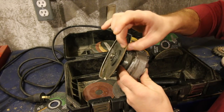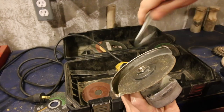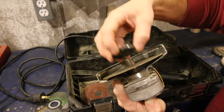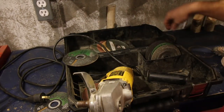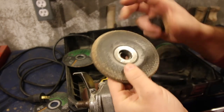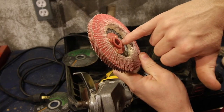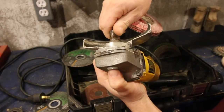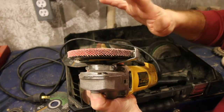You can cut and sand just about anything with a good grinder. One thing to be aware of: if you're using different wheels and sanding discs, there are different ways to attach them. For our cutoff wheel, we have this lock nut and it comes with a wrench. You have a backer that you need to put on the back side. On your grinding wheel, it's the same thing — you're going to attach it the same way. On this style sanding disc, it's threaded. Ours has a button on the back side you push in and that locks the head, otherwise it can just freewheel on you. Push your button, spin it until it locks and hold it in place.